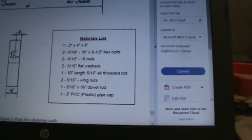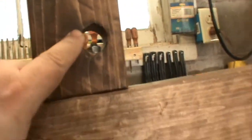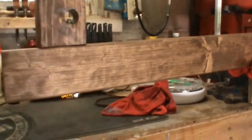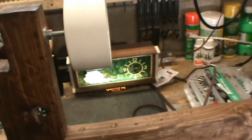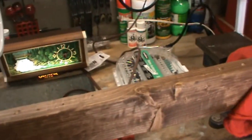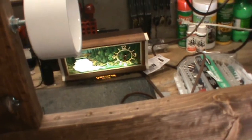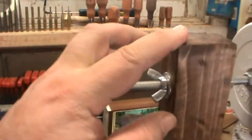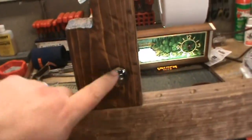I didn't add the 2x4x8 on my list because it's scrap. See where that hole is? I've used this before — this was part of my son's old bunk bed. You will need a 2x4, 8-foot — get a stud, they're cheap, a couple bucks. Or if you've got some scrap, this one here I believe was 36 inches long. And these two uprights, I believe, are 5 inches apiece. You'll see it in the diagram.